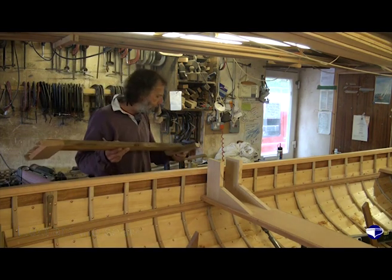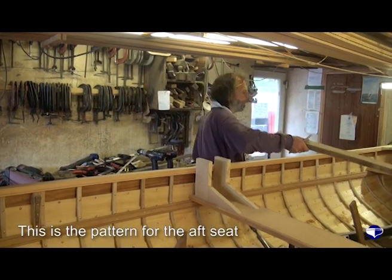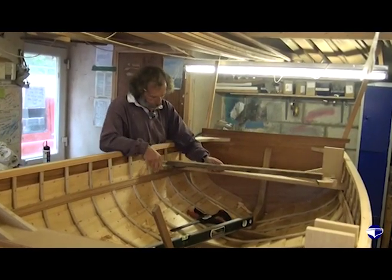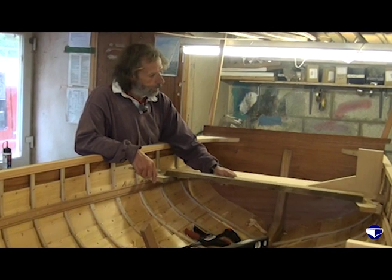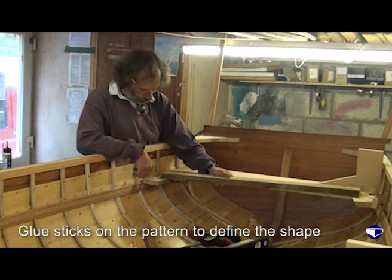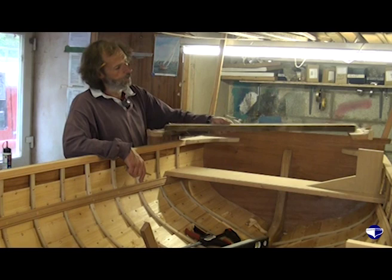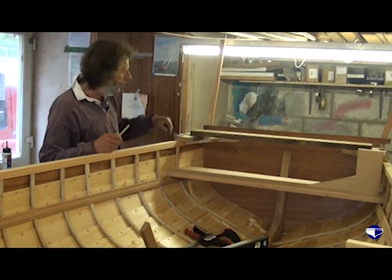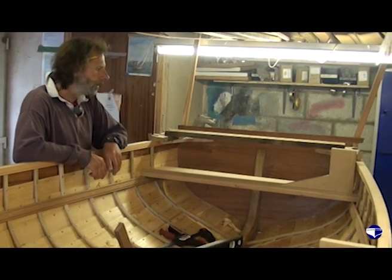This is how I tend to fit the seats. This was the pattern for the after seat. So I just make up a bit of timber with blocks on the end, the same thickness that the seat will be. Put it in place with the hot melt glue gun. Just stick little sticks on to give me where the ribs are, the angle of the planking, everything like that. Then drop it on top of a planed piece of wood, and with a little square marked down, copy all the positions and the angles, then cut it out,